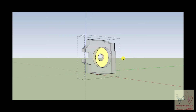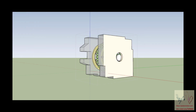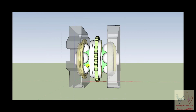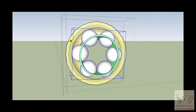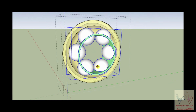All right. Oh, and again, notice the gear, notice the spacer. It's the exact same design as before. Now, these balls are a little bit bigger. What happens is the amount of space that you have available in here for your ball nut and for your ball shaft, that diameter of that space opening is determined by either larger size ball bearings, 1, 2, 3, 4, 5, 6, like I have here, or you could have little ball bearings, but you'd have to have a lot more of them. And I thought perhaps having a few of them is a better deal.